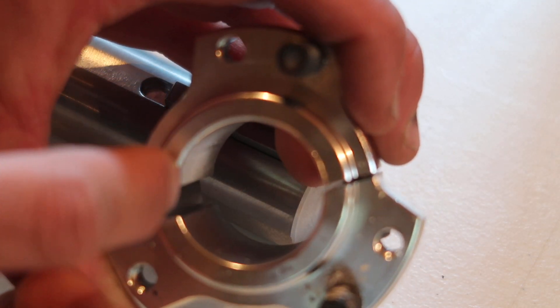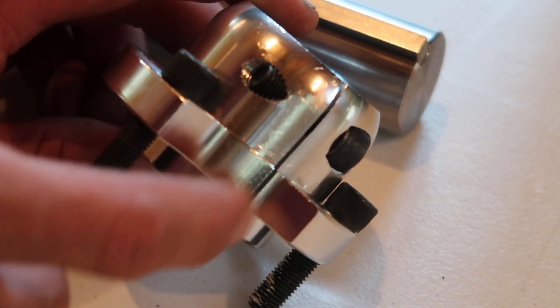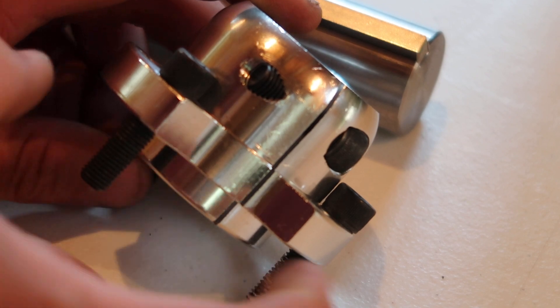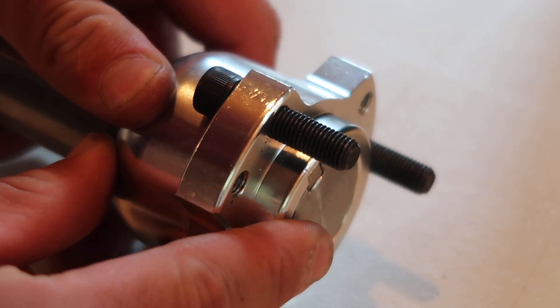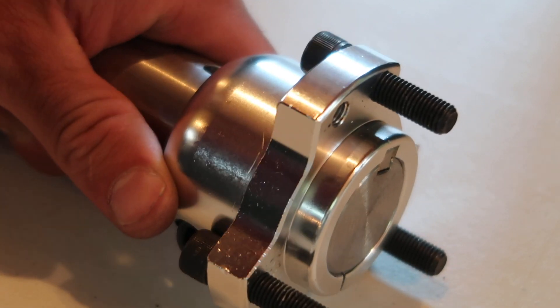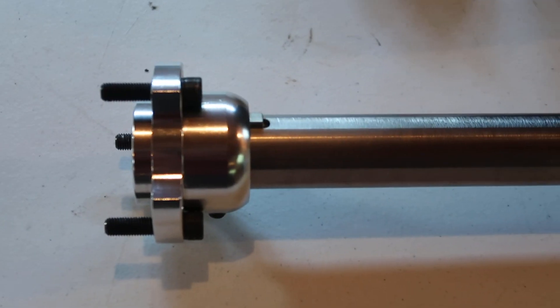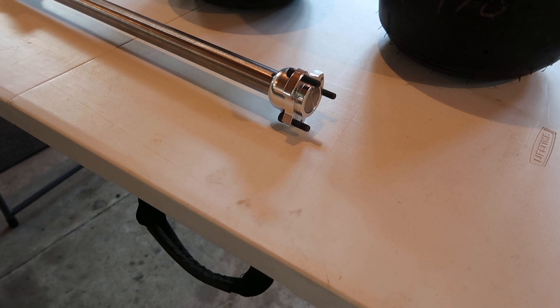The key is already in the keyway. You want to line that up with the internal keyway that's cut in the hub. Because it is split right through here, it's tapped on this side — you tighten this and it will draw that together, which is what's going to cinch it up on the shaft. I just tapped it until the faces are relatively flush and snugged it up. I'm not torquing anything to spec right now — I just want to make sure everything lines up. You repeat that on both ends of the shaft, and now you have your axle assembled.